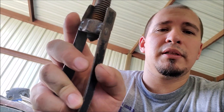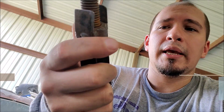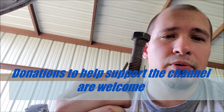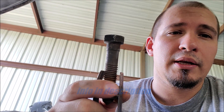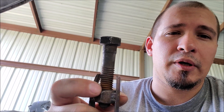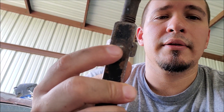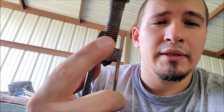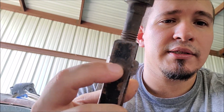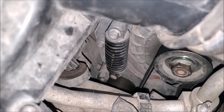Well, I made this tool for free because I had these things laying around. I cut this strip at approximately 14 inches long, and then the width of it is approximately an inch wide. Then you need to find yourself a nut and bolt — the nut that is approximately an inch wide, preferably a little bit wider than one inch, but one inch will do. Then you're going to drill a hole at two ends of your strip, and that is where you're going to weld directly to your nut. Then you can run some other beads right here along the sides just to fully secure that little strip of metal all the way across.